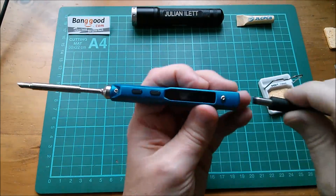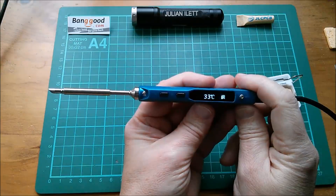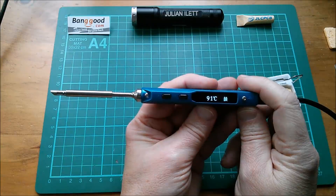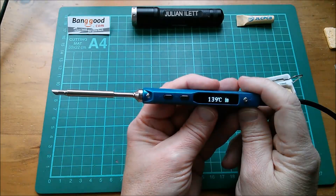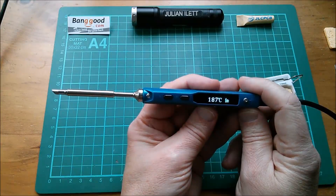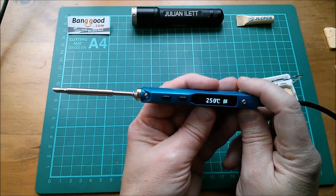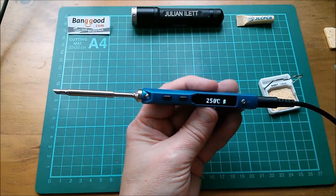Let's plug in the power cable — it goes into standby, press the button — and now it should ramp up to 250 degrees instead of 300. It doesn't seem to be going wild and crazy now, it's settled down. So I've changed the default switch-on temperature from 300 to 250 by editing that config file. I can nudge it back manually to 240 — not sure if that's going to be warm enough yet.